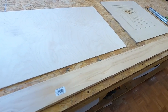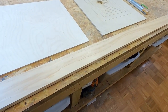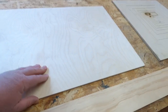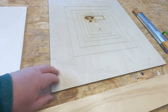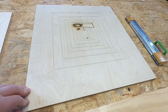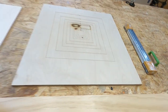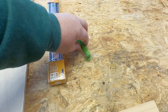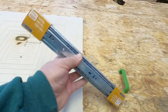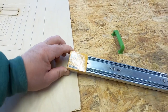This project is going to consist of six pieces. For the front of the drawer, I'm going to use a piece of one-by-four select pine that I picked up at Lowe's, which should match the cabinetry already in the camper. The bottom of the drawer will be made from a quarter-inch piece of Baltic birch — a scrap piece from another project. I also noticed there's enough room to cut drawer sides from it. I went ahead and 3D printed a green handle to match the others. And in this build, I'm going to be using a 14-inch ball bearing drawer slide.